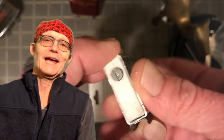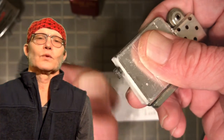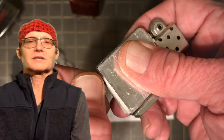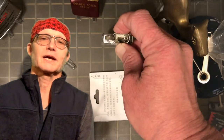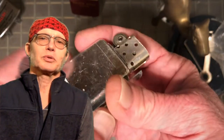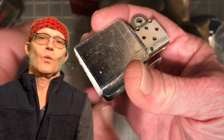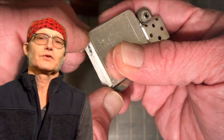Experience will tell you that's because there is a degraded, decayed, dried-up, concreted flint that is obstructing the tube. While we're at it, we're going to remove the old scrawny wick and replace it with a copper woven Zippo-type wick. I am not going to replace the wadding — I am just going to reuse the solid foam fuel cell.